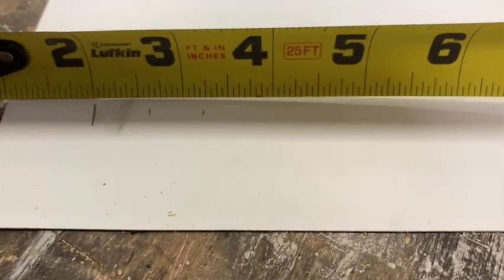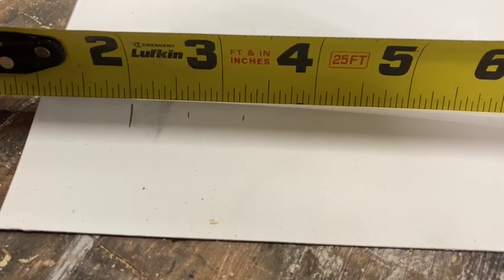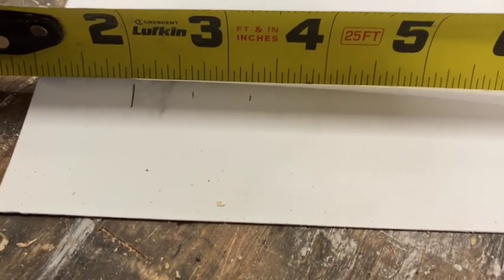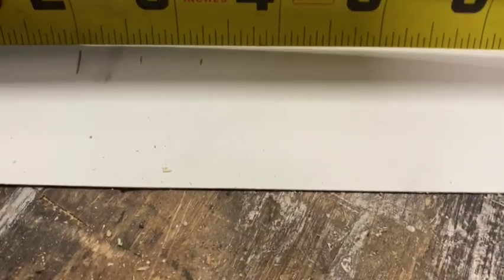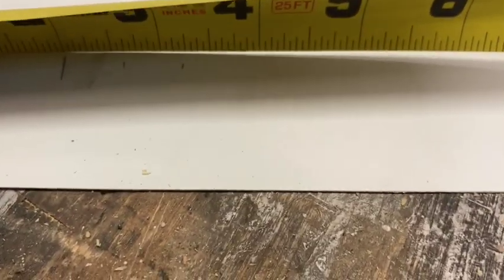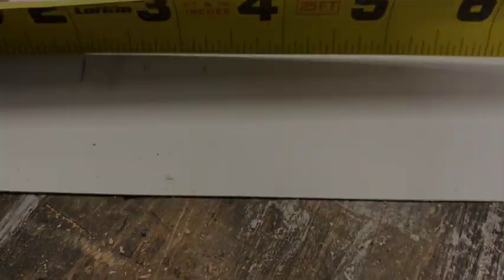Okay, so the brick mold on the door is 1.25 inches. So we're gonna make it 1 inch so that in case the wall's not even, it will not touch it. So holding 1 inch, we mark 2 for 1 inch, 5/8 because that's the bend that my brake does. That will go down, and then another 5/8 for it to flex up to make a drip cap.